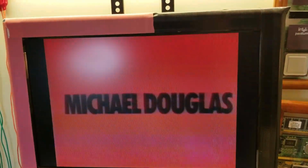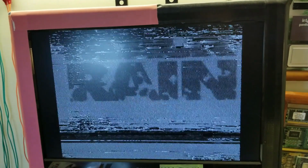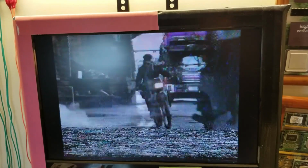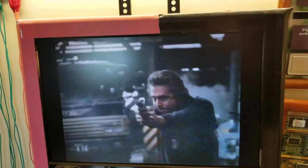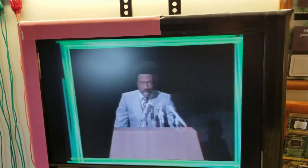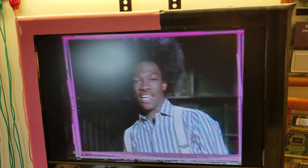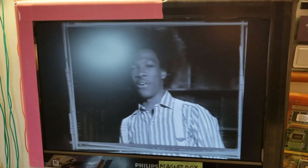Fast forward. Look at how fast it responds back in play. Rewind. That idler tire is a little bit worn, so rewind is not as fast on this as the Sony. Fast forward's nice and speedy. Pause is pretty decent. This is on Beta 2, so you can't really expect, oh, there's not even color there.